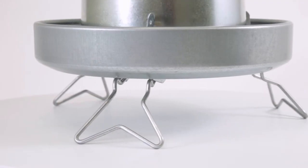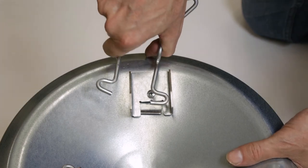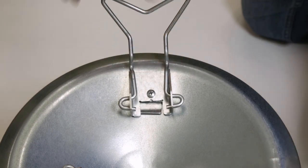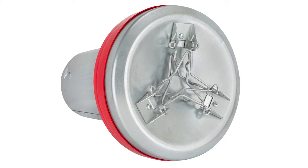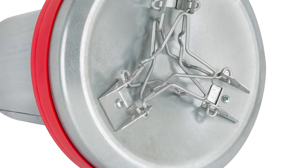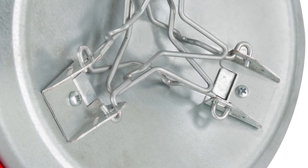With the hopper attached, it's time to install the legs. Hold them in the palm of your hand with the tabs extending out from your thumb and index finger. Slide one tab into a slot on the base bracket, then squeeze the leg together until it slides into the adjacent slot on the opposite side. The angled slot on the base bracket raises the trough higher off the ground than the horizontal slot. If you want the trough to remain flat on the ground, you can either insert the legs facing towards one another, or just do not install them at all and set them aside somewhere for safekeeping.